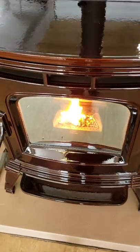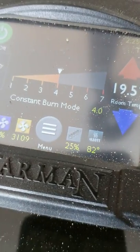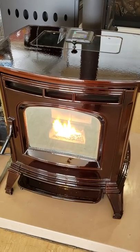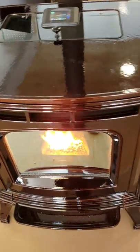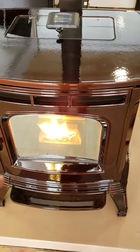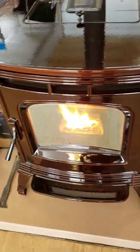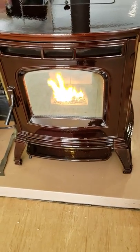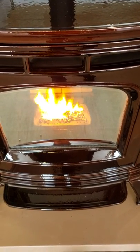Here we go. Roughly about five or six minutes and the fire is lit up and going. Our temperature has now popped up really fast to 82 on our igniter setting — which is also our ESP probe. A couple of things to remember: pellet quality can really affect the way these stoves work, or how fast they light. If you have a bad pellet, it may take a little more effort to get the fire to come up fast and hit 60 degrees Celsius back through the exhaust system. There are also different methods of doing this — we use lighting nuggets, there's lighting gel, and some customers use a little torch to get it good and hot first. The pellets are now feeding in through the fire pot, which is pretty neat.